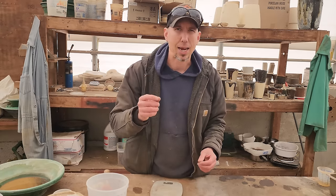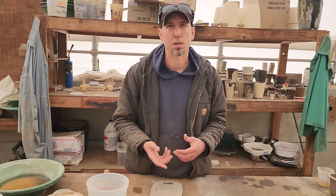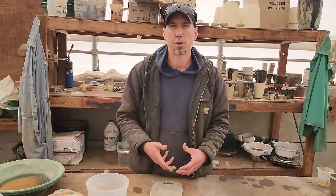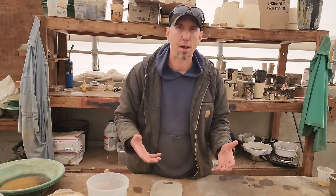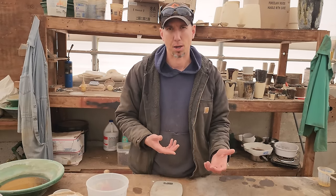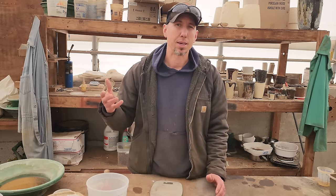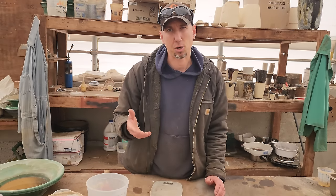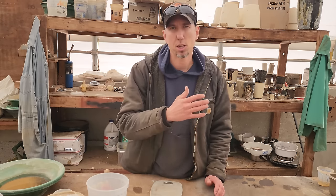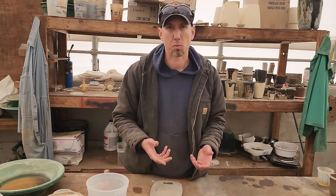When I get these little tiny beads, that's just me experimenting, looking at the value of the sulfides, seeing how much gold's in my concentrates. So not all the smelts that I do are worthwhile and I'm making money on. It's just more of an experimentation. It's an assay process. But if you're going to go into production smelting, your concentrates need to have at least 1 gram or 2 to make it worthwhile. The whole process all the way through takes probably a couple of hours. You really need to have enough gold in there to make it worth your while.